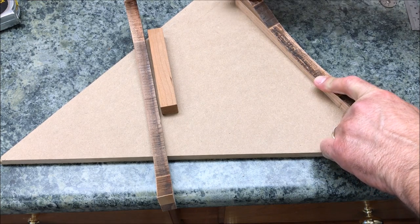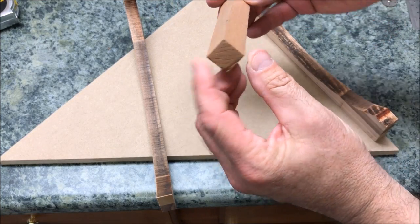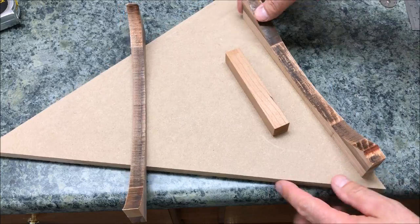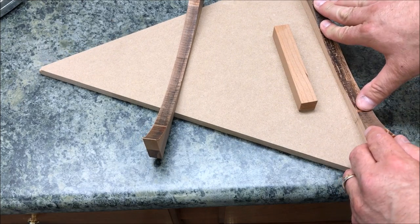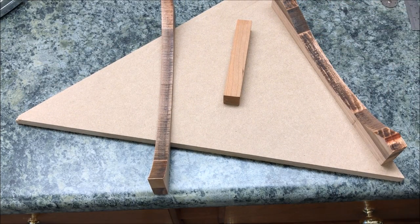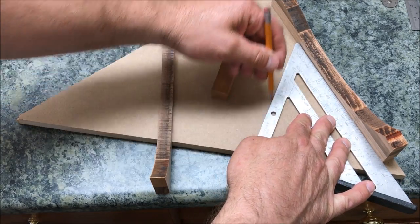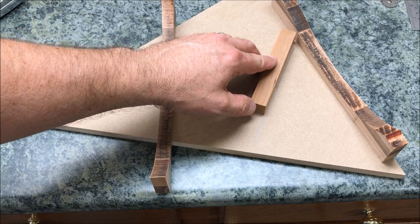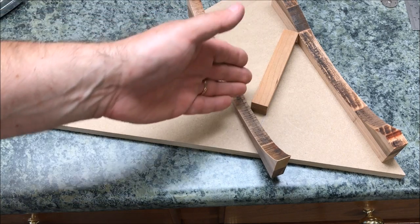I put the scrap down at a bit of an angle — I angled it and laid it on the edge, then rolled it toward the outside edge of the blank. The idea was that any squeeze-out from the glue would squish out the outside of the blank and not the inside, which could throw me off on getting my pencils right up next to it. I'm going to use my square and lay it against the piece of scrap and just draw myself a line. This will give me a 45-degree angle that'll allow me to start laying the pencils side by side and use this blank to make sure it's long enough for me to get full-size blanks out of it.